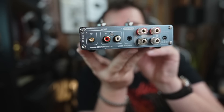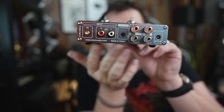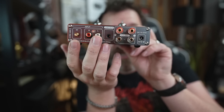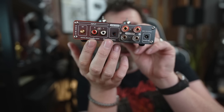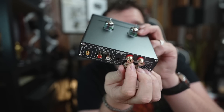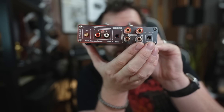What's on the back? Pretty straightforward. Over here you have the Bluetooth antenna, RCA inputs, line out — think subwoofer or tube buffer, although I think there are better options. Speaker binding posts, pretty typical for an amplifier of this price range. And then over here, power — 12 to 24 volt, no more, no less.